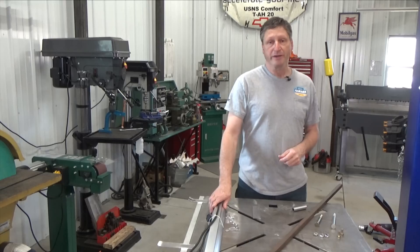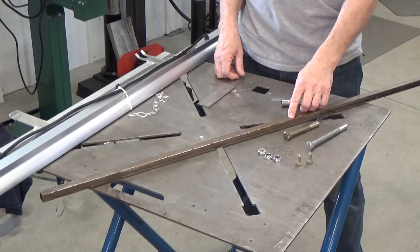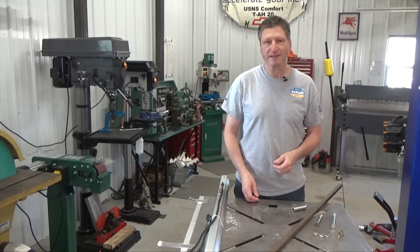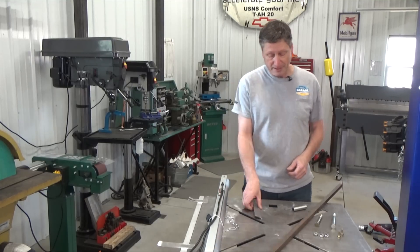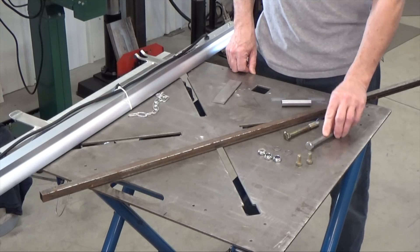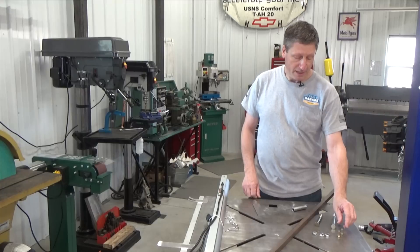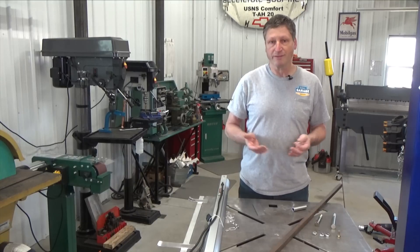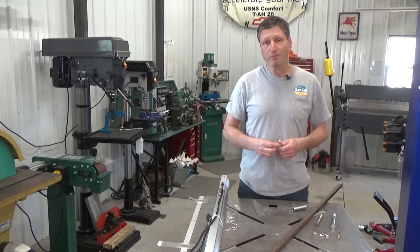Here's what I'm using: one four-foot LED shop light with a chain pull switch, 50 inches of three-quarter-inch square tubing — the length is determined by your shop light, just long enough to extend an inch or two past the ends. My four-foot shop light was actually only 46 inches. Also: inch-and-a-half by eighth-inch flat stock, a four-and-a-half-inch half-inch bolt, a six-inch half-inch bolt, three nylon nuts, a couple of half-inch washers, and two three-eighths bolts to mount this to my steel building. If you have a wood structure going into studs, lag bolts should be fine. All of this you can get from your big box home improvement store.